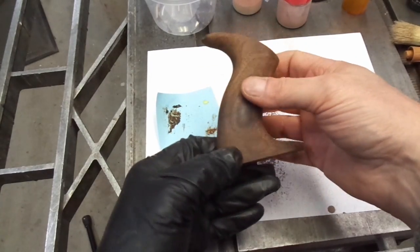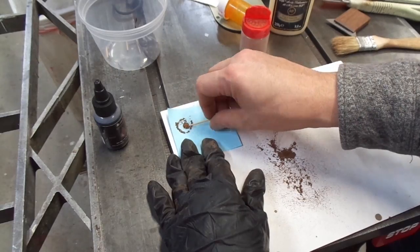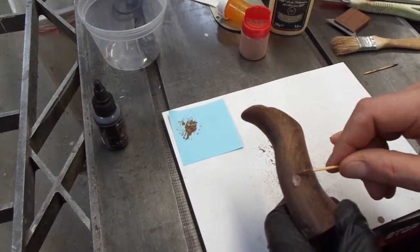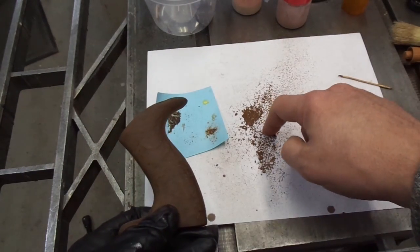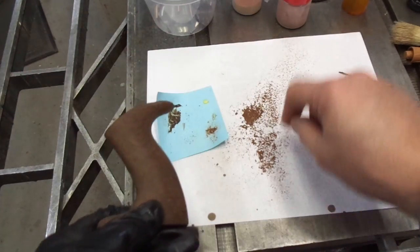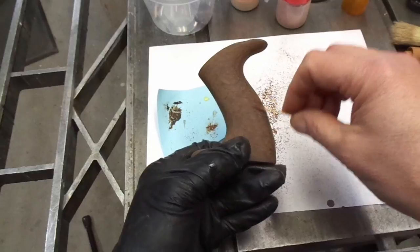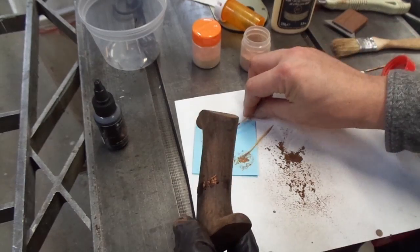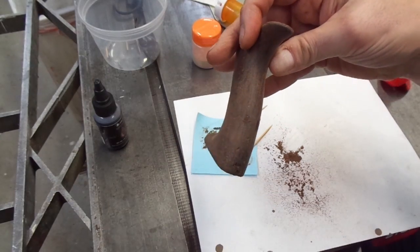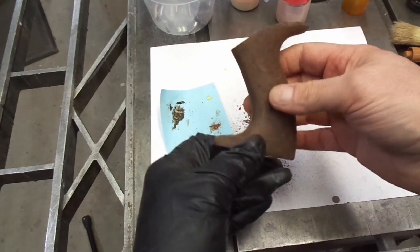Okay, so here's an update. After I glued the two halves together, I filled in the seam with a couple pastes of wood glue and sanding dust — this is the rosewood that I sanded, and I also have some mahogany. I would force it into the cracks and then try to burnish it in by rolling a toothpick over it. Once it dried, I would sand it. And I ended up doing that two, three, four, five times.